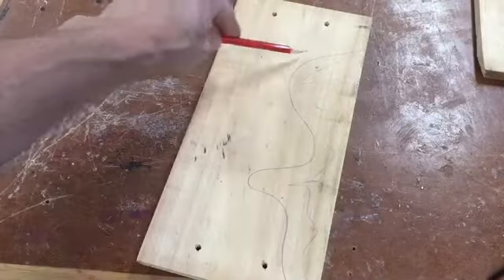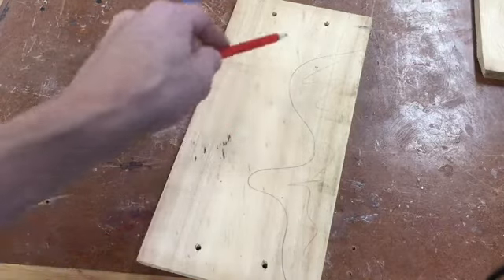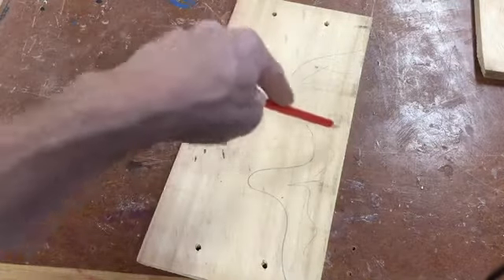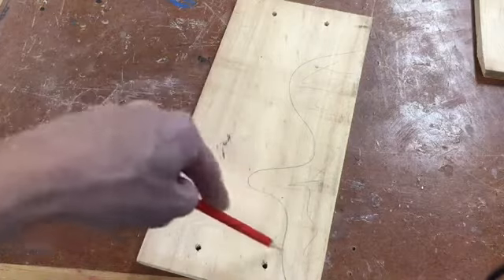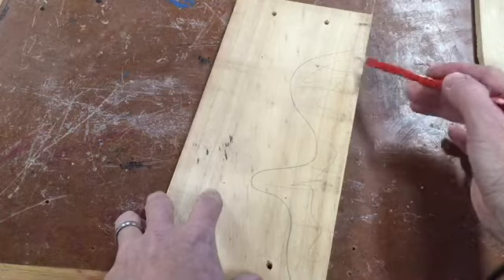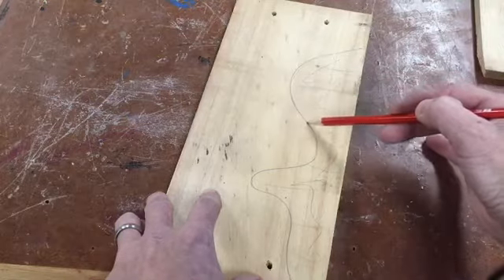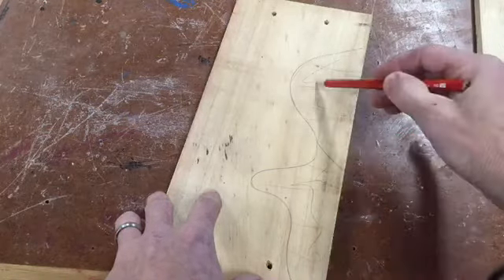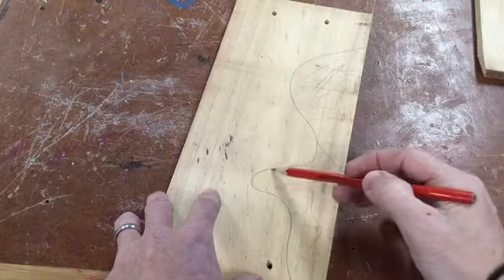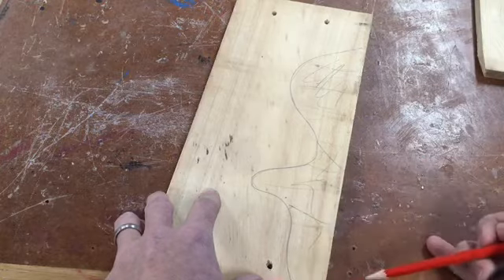If you ever plan on doing a complex curved cut, the best idea is not to try and do the whole cut in one go. Even doing relief cuts is one way of helping, but one way to make the cut a lot easier on yourself is — after doing some relief cuts — to start along your line, then bring the blade straight back out to get rid of material first, do some more relief cuts, carry the cut through, and then come back around and complete your cut.